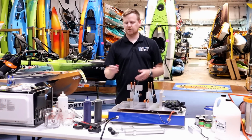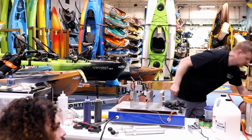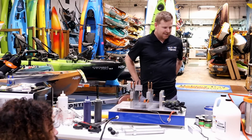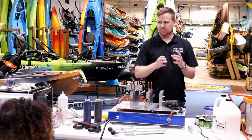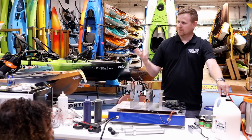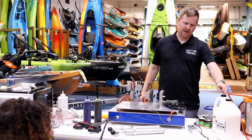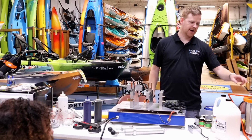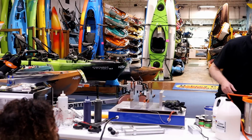So there's a basic example of color dosing. Can you talk about, Chris, the effects of moisture on your plastisol? So the polyvinyl chloride resin absorbs moisture. Once you crack a jug or a bucket of plastic, any moisture in your environment, say a hot and humid garage, is going to get into your plastic, which is going to create more bubbles. That's why this becomes a lifesaver, especially in our climates around here.